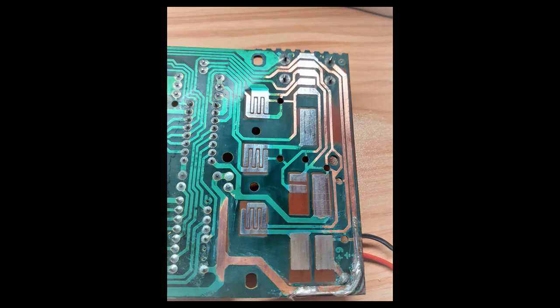As you can see, there has been a repair on the bottom right hand corner of the photograph where the power leads come in from the battery. Well, that's because when I was scraping it off, the corrosion at that point, because it was so close to the battery, I suppose, had taken chunks of the copper away completely underneath. And so when it was scraped off at the top, there was no track left. So it was hanging on by its bare teeth, and if I hadn't done this, this would have failed at some point in the future. So it was the right thing to do to take it out, and there it is, nice and clean now, and all repaired, and should be good for quite a few years to come, I hope.